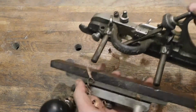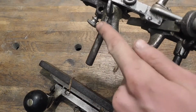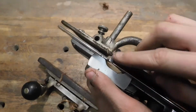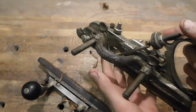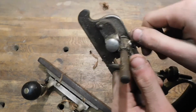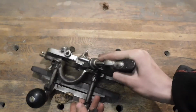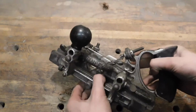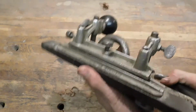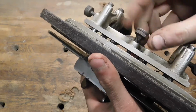like so. Well, you could just take it off. So you actually do get longer bars to do wider jobs, and to make it the width of your blade. Now these look like they're very futuristic, but these were actually made back in around the 20s to 40s era, as I said previously. So that's the basic plane itself. You can move it down here to whatever height you want. You can move it up if you want the fence deeper, and if you have to do a very fine adjustment, you can move the fence in and out with this little adjusting screw.